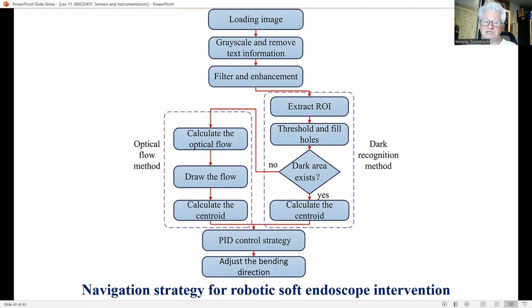Another possibility to measure speed makes use of the natural irregularities of the floor surface. At 2 positions of the vehicle, front and rear, the random intensity variations are measured. The speed follows from correlation of the 2 random signals. Absolute position is then obtained by dead reckoning techniques, starting from a known position and possibly updated from time to time with reference positions achieved by special markers or beacons.